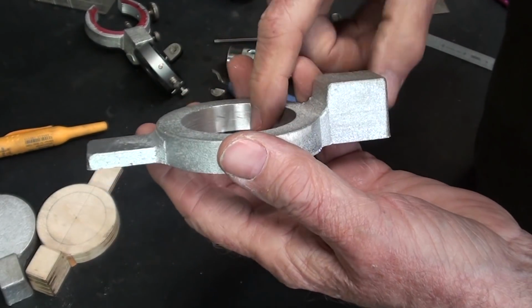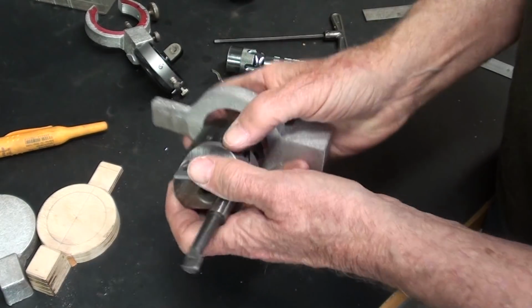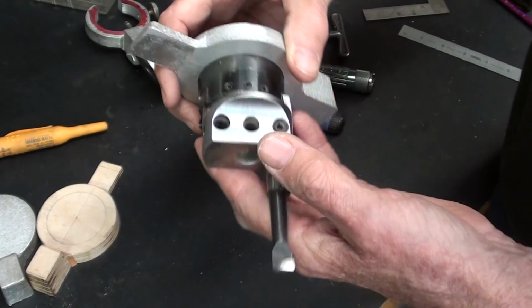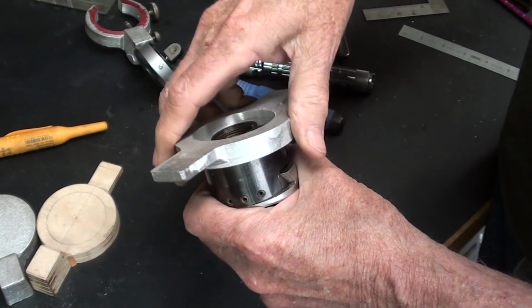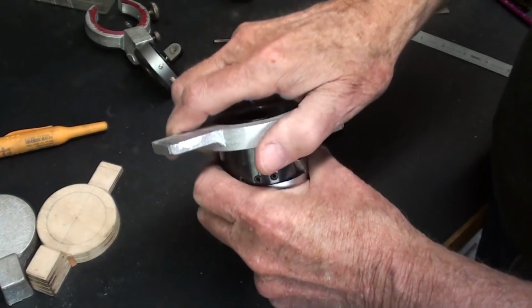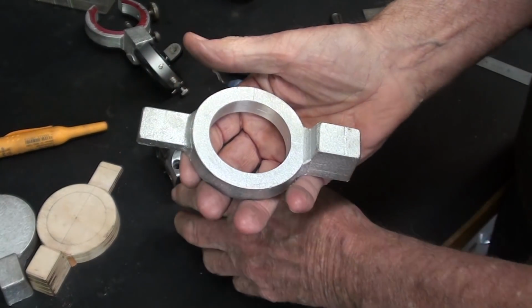Okay, got quite a good finish. I galled it just a little bit here by fitting it, and really I should have taken another 1/2 thousandth off, but it's very difficult to take just a 1/2 thousandth off because it is just a little snug. So I'm going to polish it a little bit with some emery cloth so I have just a little bit looser fit than that.